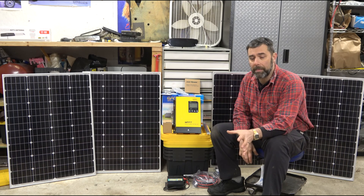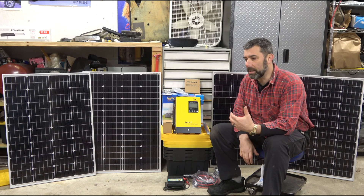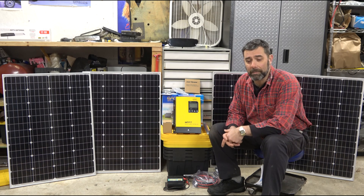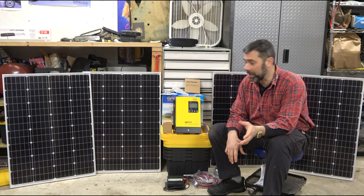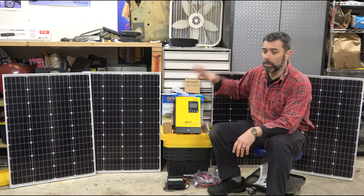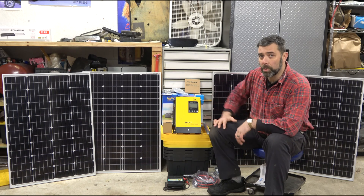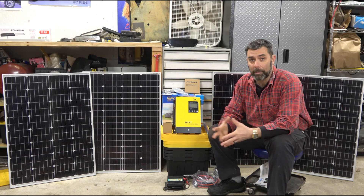If you want to live in a camper or RV, maybe — those already have efficient appliances and a 12-volt direct-connect refrigerator. But our house is a conventional house with a large water heater, dishwasher, washer and dryer — high-efficiency equipment but it still won't run off 2000 watts. Realistically we're looking at a five-year process where every year the system gets added onto — more batteries, more panels — and eventually we add a second charge controller and inverter, ending up with two 120-volt legs backfeeding into the house's power panel.